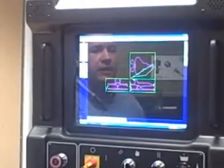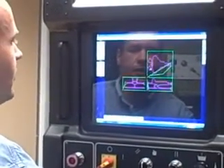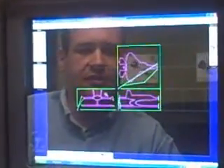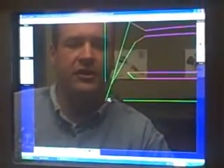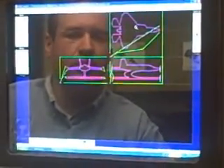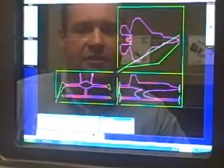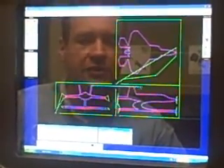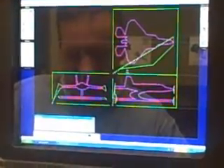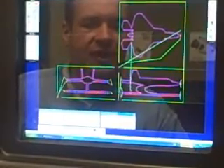I cut out my 2 inch by 2 inch block ahead of time and need to make sure that we have the block accounted for. What I did was redraw my actual measurements of that block after it was cut, so that I could determine how the starting traverse is going to line up with the bottom left corner of each of these cuts. Once I have the representation of the block in place, I make sure that my drawing is lined up and proper. I intentionally drew this so that the tail of the front profile and the side profile are lined up, and also so that the point where the horizontal stabilizer and the vertical stabilizer meet at a perfect 90 degrees.